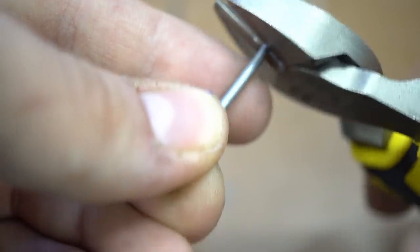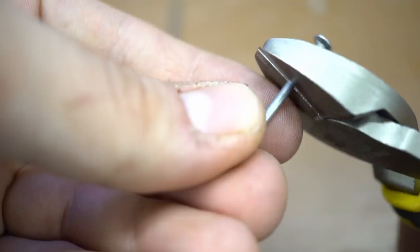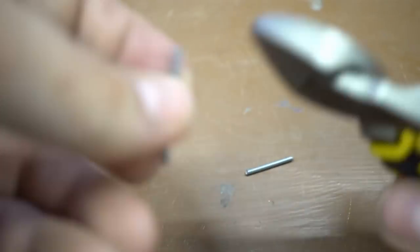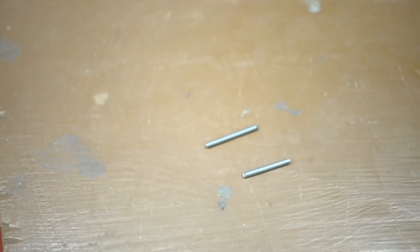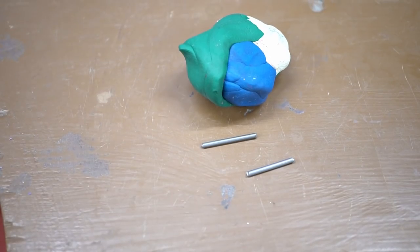Convert the sprue into a frame. Metal entering the mold should fill it with the least resistance. I'll use small nails and a piece of pipe that I duct tape to keep the plaster from flowing through a burned hole, and I'll use plasticine as a rubber base.